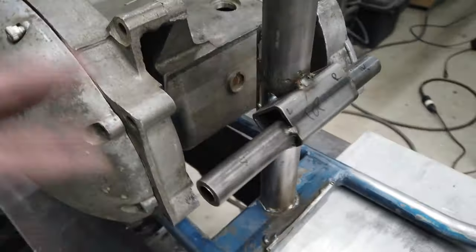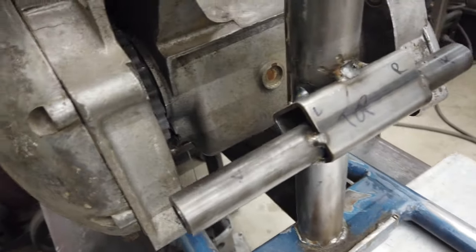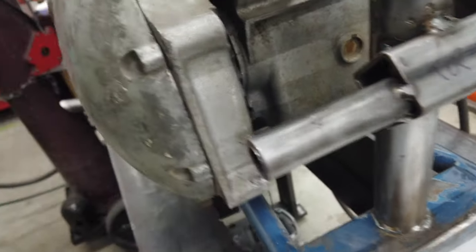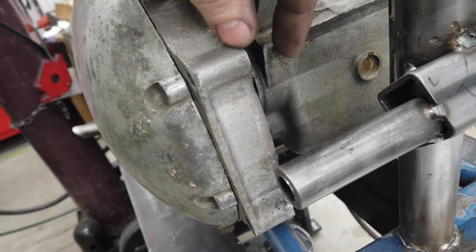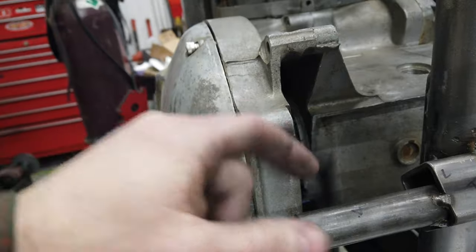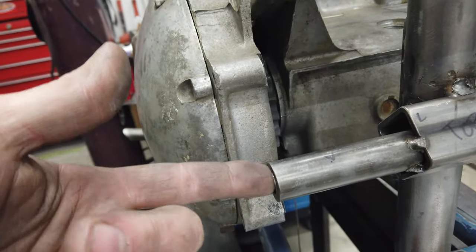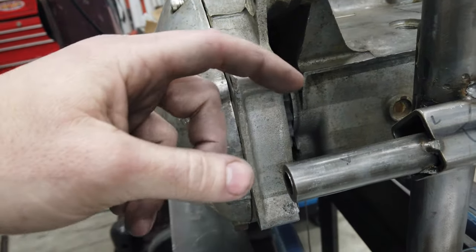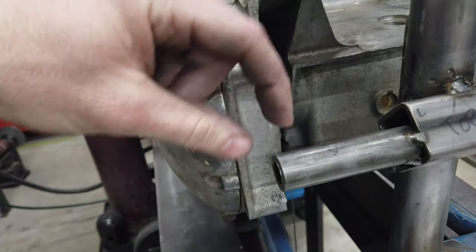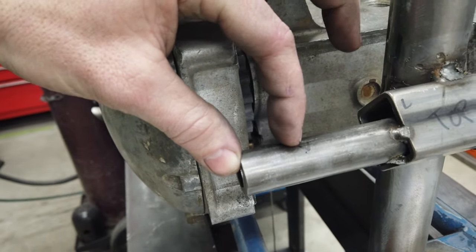Okay, I'm not so disappointed in this now that I'm looking at it. Where the engine plates normally go on this side, I'm going to have those standoffs, and I'm going to continue with the backside idea. This is thick enough wall that I would feel comfortable tapping it. I also could probably put a threaded slug in there too, but I'm going to try and tap it first and run a pretty good hefty size bolt. Then I would utilize a chunk of this as the spacer.